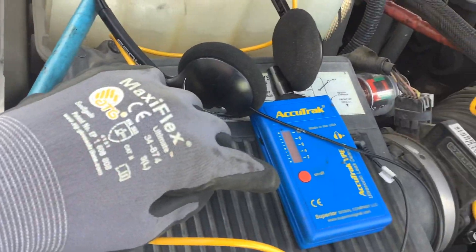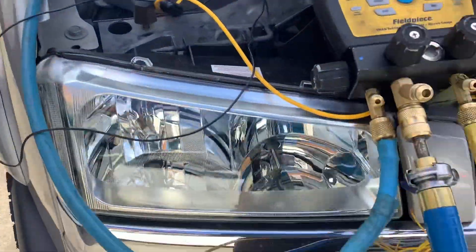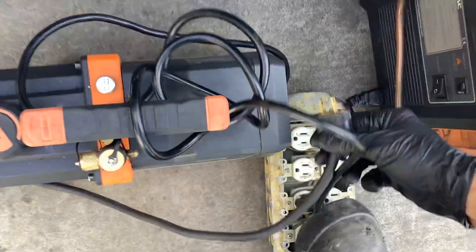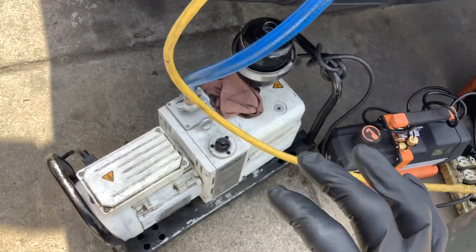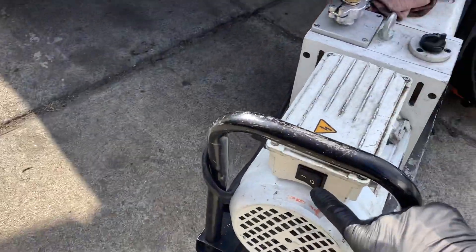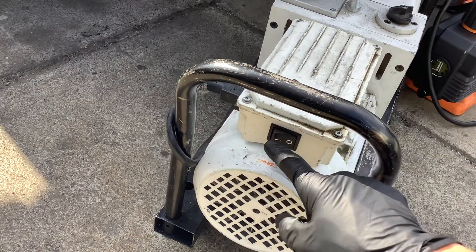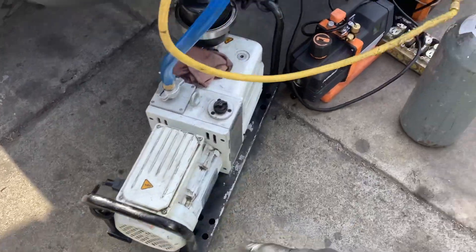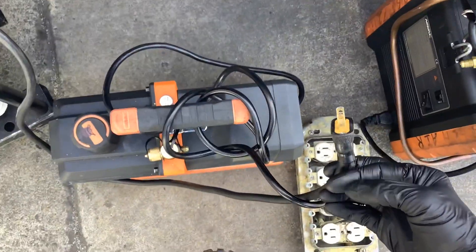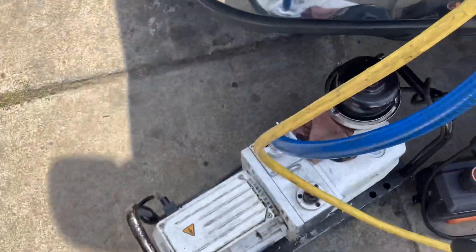I already have my ultrasonic leak detector out and I'm going to scan around the system with it. I could turn off my vacuum pump — you see how I unplug it rather than switch it? Every time you disconnect a big motor it makes an inductive arc, a voltage spike. If you're always flicking that little tiny switch, the contact points burn. Eventually you've had a piece of equipment where the switch stopped working — that was burnt contacts. If you leave it on and just connect and reconnect the plug, it's easier to change the plug than the switch. Just a little maintenance tip.